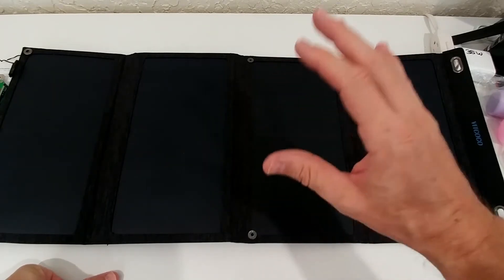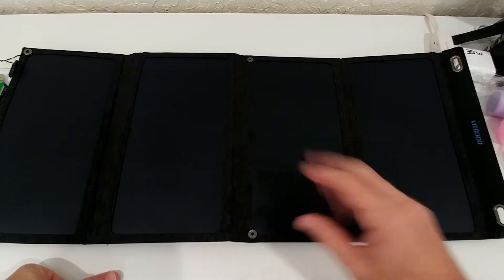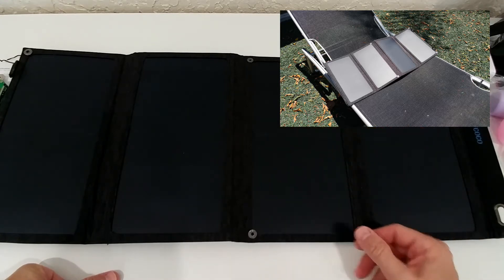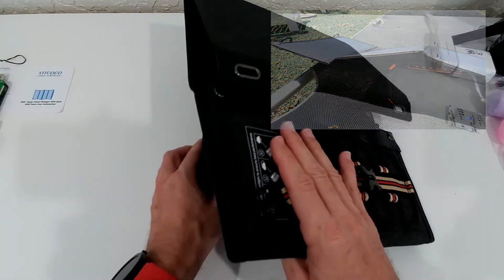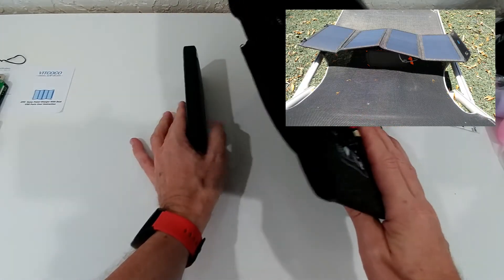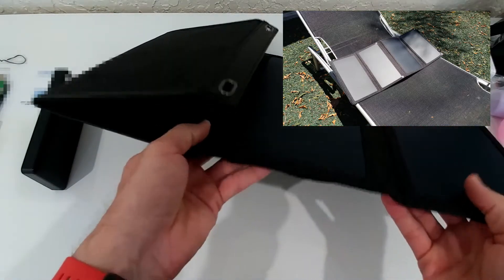I'm back now. I had it outside in direct sun at noon, in Florida in June, at almost a 90-degree angle to the sun, with dry air. That's about the maximum solar conditions you can get — even in the Arizona desert you won't get much more. It was super hot, which can reduce panel efficiency, so I tried lifting the panel slightly in an upright position with the power bank underneath on my knees, with the panels fully open.